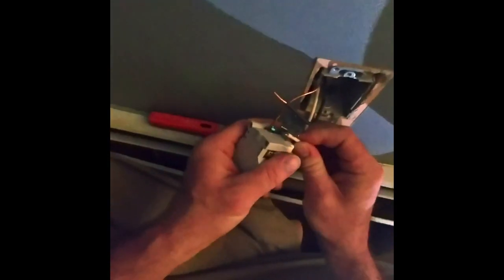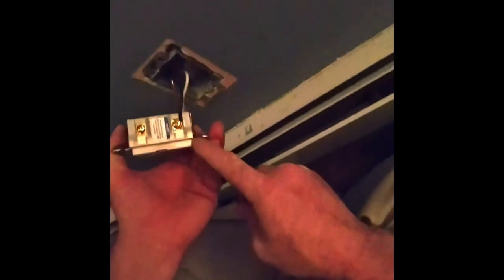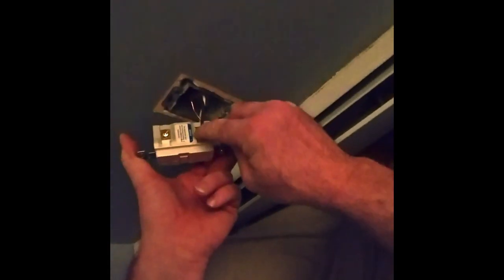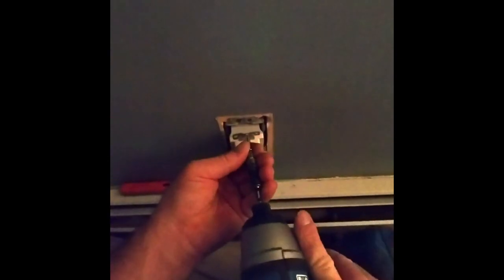So you see right here is a wire stripper. So I went ahead and pigtailed it because I like the pigtail. So this goes all the way around, so that's in there tightly. Just because pigtailing it is a better connection, so whatever she uses won't get hot and wind up blowing out on her.